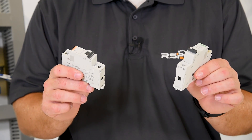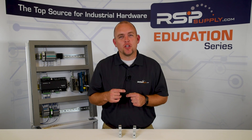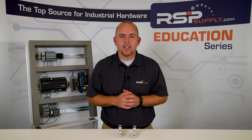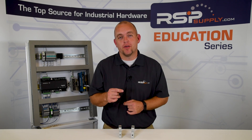One of them is a supplementary breaker, the other is a branch breaker. Both branch and supplementary breakers have been designed for specific use in certain applications defined by the National Electric Code and UL. When choosing breakers in electrical design, it is important that we take the differences between supplementary and branch breakers into consideration. Using the wrong circuit breaker in certain applications can be very dangerous and definitely should be avoided.